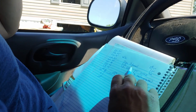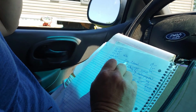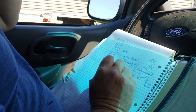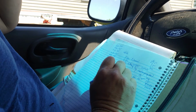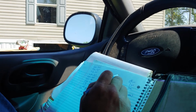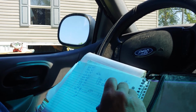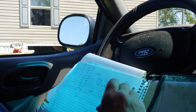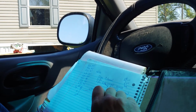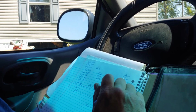All right, now I need 21 pieces of J channel. Two pieces of rake and corner. The regular. And then I'm going to do what I call the top front, but it is an inch and a half down, inch out, 3 inches down with a hem on the bottom. I need 21 of those, and white on the outside.